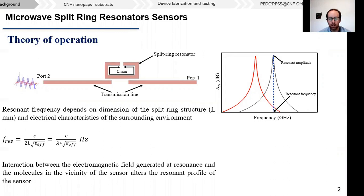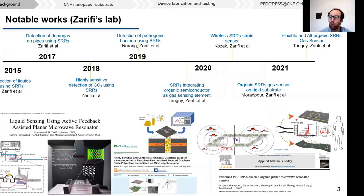This technology stems from the simplicity of the device architecture. Through the making of a split ring strip line using metal, we are able to produce a resonant profile. Any alteration in the device characteristics or the surrounding environment will cause a shift in the resonant profile, including amplitude and frequency. Using this concept, Professor Zarifi has done quite a bit of work for applications as sensors, including the detection of liquids, gases including carbon dioxide, as well as bacteria, ammonia, etc.